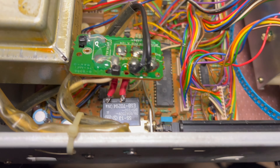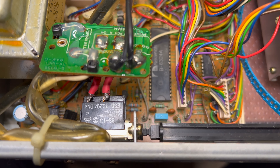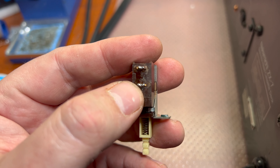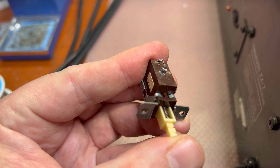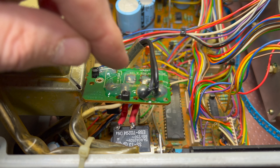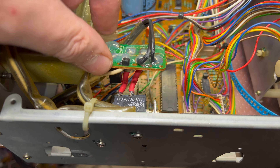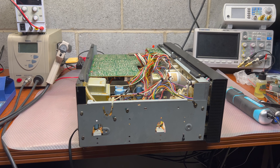The new switch is now installed. From the front panel it has more metal parts and is overall better made. The old switch was just soldered directly into the board, and someone had cut it off. I'm using hot glue so it cools down and fully covers the area — no one will be able to touch high voltage. The board is now soldered on thick wires, so I'm pretty sure it will last. Now it's time for the truth — let's try to start it.